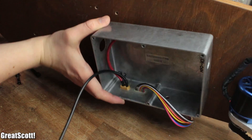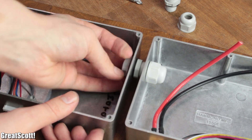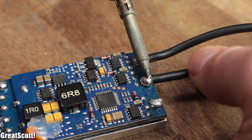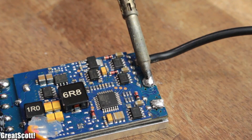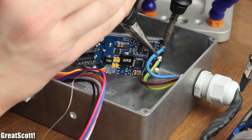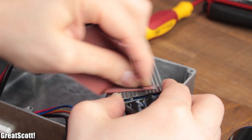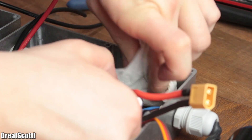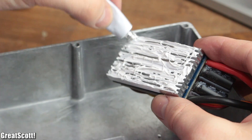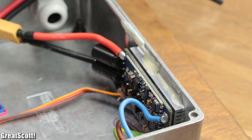Once the wrapping and mounting was complete, I continued by securing the enclosures and cable glands in their final position and also started modifying the ESC. This means I removed the original three wires on its output and replaced them with the extended wires of my motor. Then I treated the aluminum surface of the inner case and heatsink of the ESC with sandpaper and acetone and used thermal glue to bond them together.